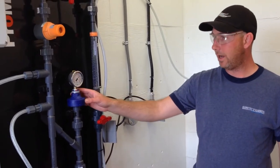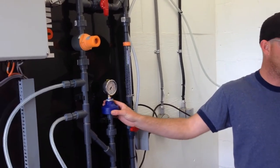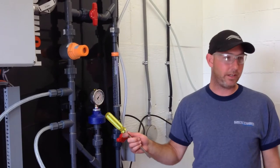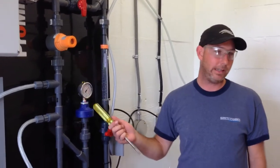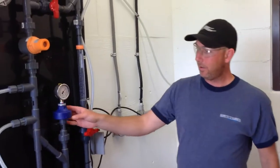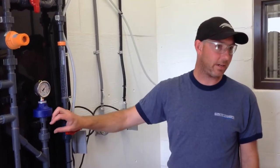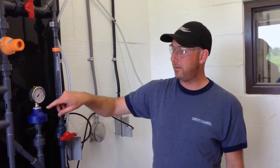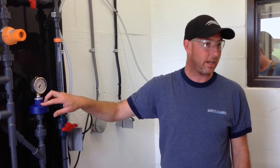You shouldn't have the issue, but I know that this guy, the isolator, is the weak point. It's rated at 150. If you use it at around 150, I've seen them leak. Because chlorine attacks metal, you have to have something in between. So there's a diaphragm right here, and then depending on what they fill it with, like glycerin or something, on this side.